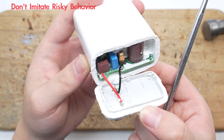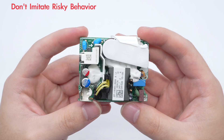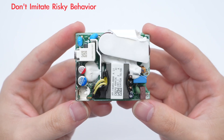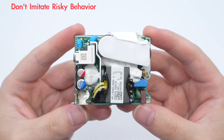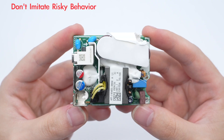The wires are cold-pressed and soldered to terminals. A sponge is attached to the top of the capacitors. A plastic isolation plate is placed between the primary and secondary sides. The USB-A socket is reinforced with a plastic housing, and a metal heatsink is also installed to dissipate heat from the synchronous rectifier. The gaps are filled with potting compound.